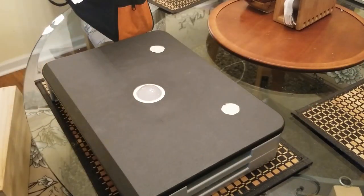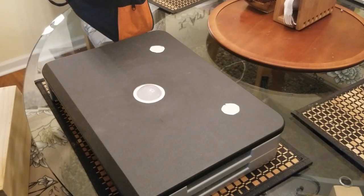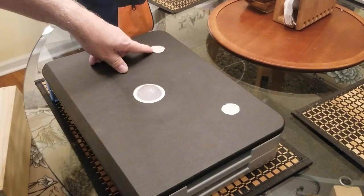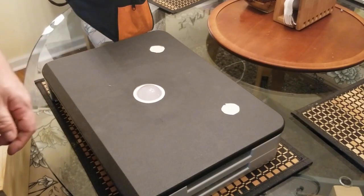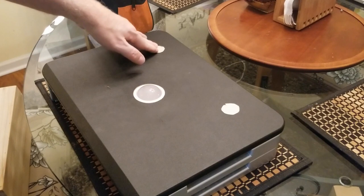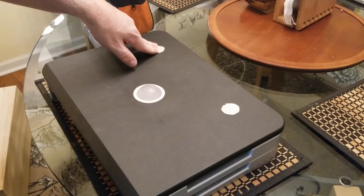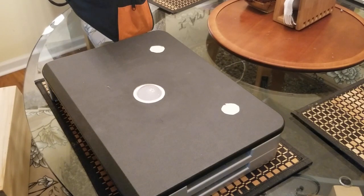And of course, you're gonna wanna measure from here to here and here to here and make sure it's all symmetrical, and make sure you don't go too far to the side, because this is gonna block access to that part of the board. So then you can mark the spots where you're also gonna put the buttons, and you want them placed in a way that is very symmetrical. The nice thing about masking tape, by the way, is it can be easily removed, so you have an easy way of adjusting the placement of where you want these holes. By the way, for the holes you're going to cut for the joystick and the spinner, you're going to use a hole saw of 1.5 inch, or maybe just shy of 1.5 inch. Mine was just a little shy of 1.5.